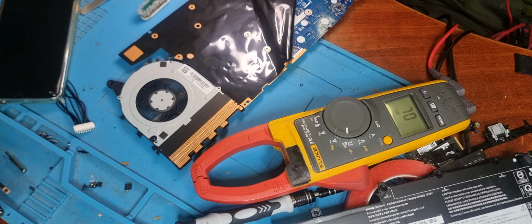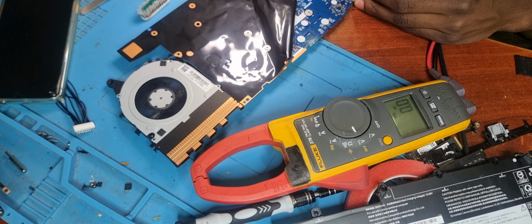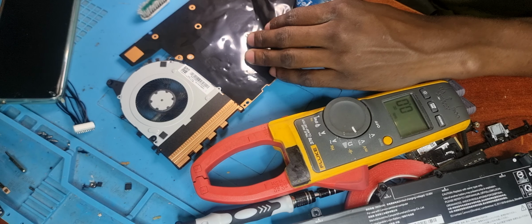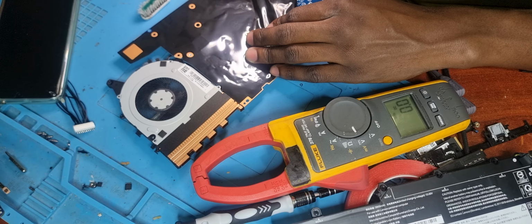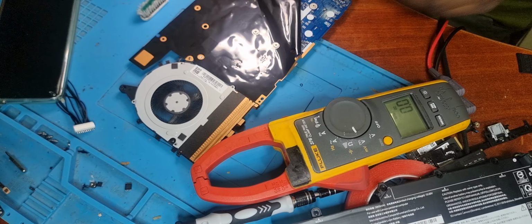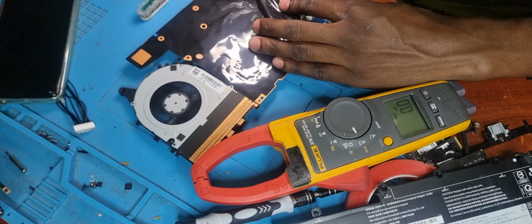Anyways, I'm just gonna show you a trick. Well, I still have 20 volts coming in, 3.4 volts coming out. So yeah, pretty much the same issue with the connector over there. And as if I short the fuse to the 20 volts, you'll see what happens. Okay, I'm putting it this way. And then I'll short this fuse to the 20 volts supply.